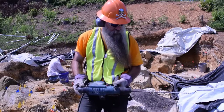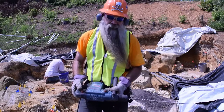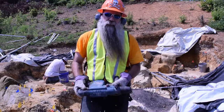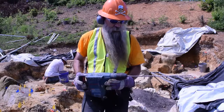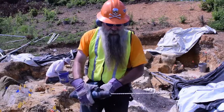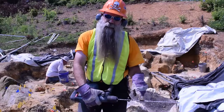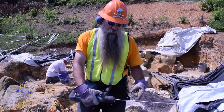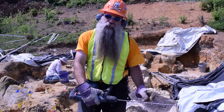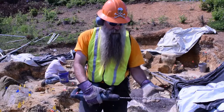If you noticed when I was drilling, it might have looked like I was holding it in a really awkward position. What's nice is this is a hammer drill, so it pretty much does all the work for you. All you have to do is hold it in place, and it'll do everything for you — it doesn't take a lot of effort. You'll also notice the drill bit has several marks on it, red marks. These represent the number of charges. So if I'm only going to put in one charge, I drill it here; two charges here; three charges here. So I can put up to three charges with a single head for a single explosion.